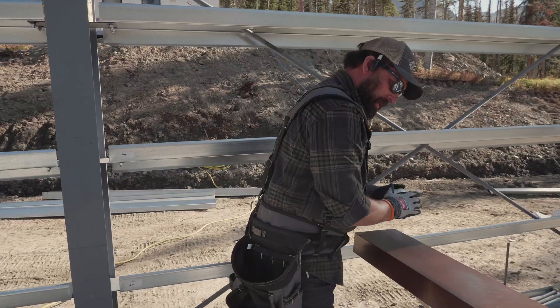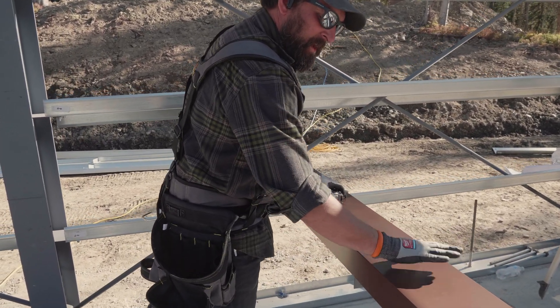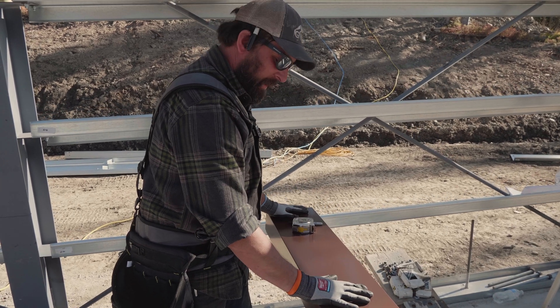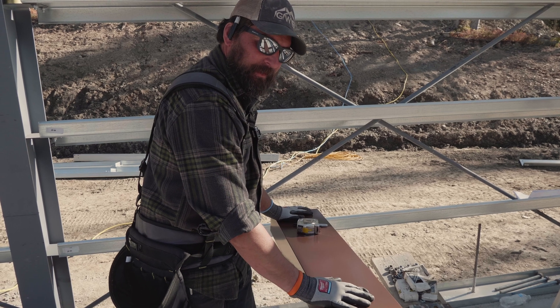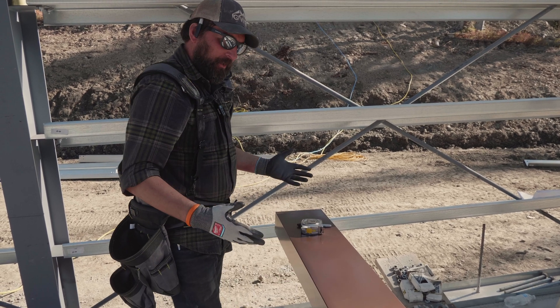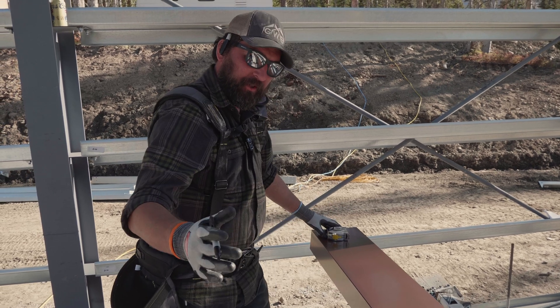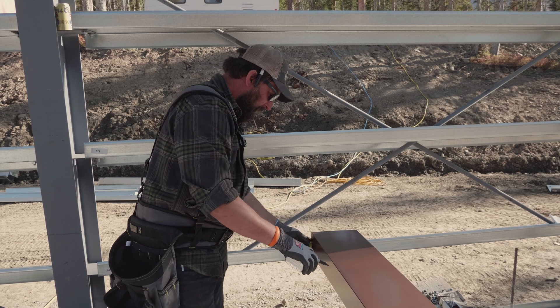While we're filming, I thought I'd go ahead and show everybody how I do this. The trim comes with a plastic coating on it — I always pull the coating before I throw the trim on. It just means you've got to be extra careful with it. I don't like doing it after pop riveting because once you go to start peeling the plastic back, it always hangs up and it's almost impossible to get it all out of there.